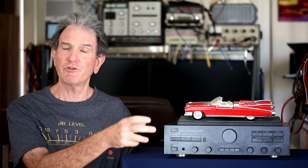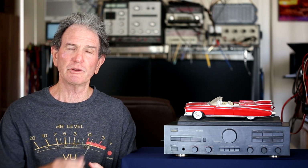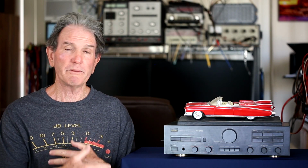I did hear a bit of scratchiness in it, and then when I got up to around the 0 dB gain point, which is I think 15 or 16 on the dial, it started getting some distortion. Some of that was acting up, and then you could move it a little bit and it would go away. So that pot does have a bit of issues. However, when I was listening to it at the 0 dB point, I was at 96 dB SPL. It was pretty loud. The Carver was cranking, and I'm not sure how many people will be playing that loud.